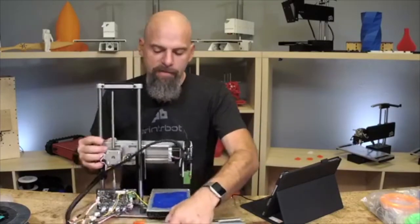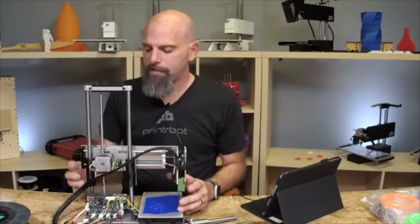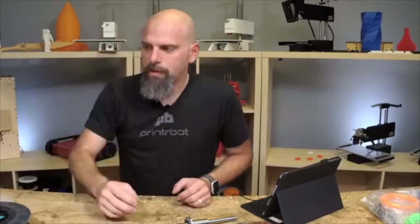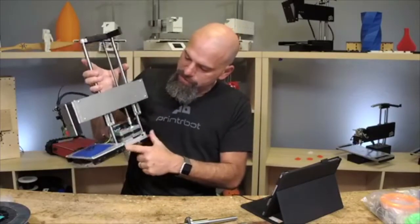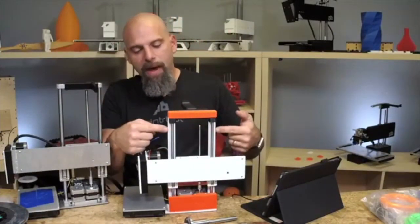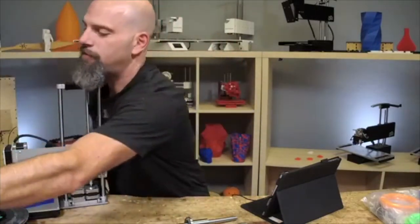And to get rid of this front plate, that's going to be printed, so I'm going to move this in a little bit. So anyway, all that I'm trying to say is I've got the design, and I'm testing it, but I want to make some little improvements to this clamping system. And also, I want to use these. You see how much cleaner this 12 millimeter bars is, as opposed to all of this that goes on this one. You have your bars, and then you have this backing plate to keep it stiff. Well, that complicates things. And for a printed bot, you don't want to have to require metal. That was there for stiffness.